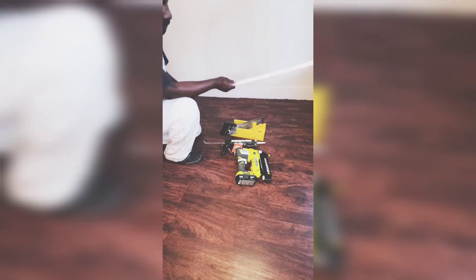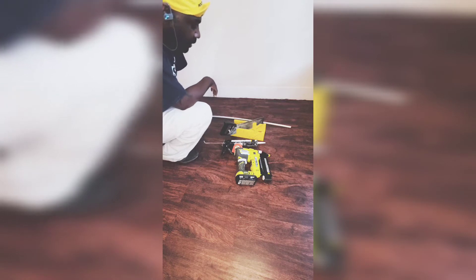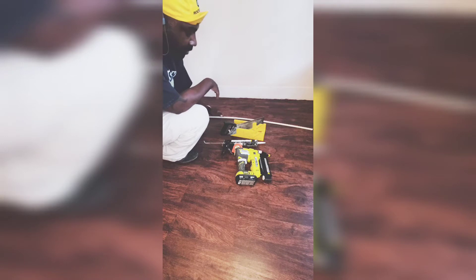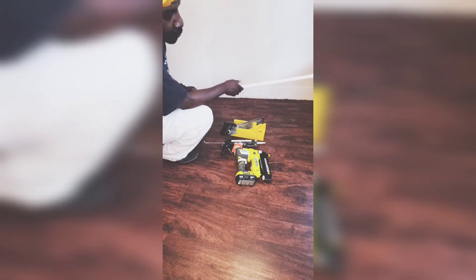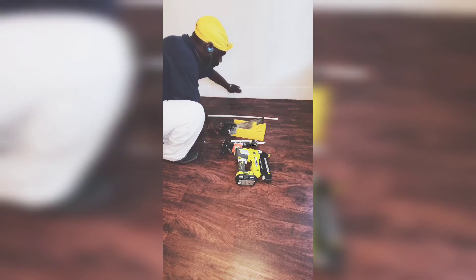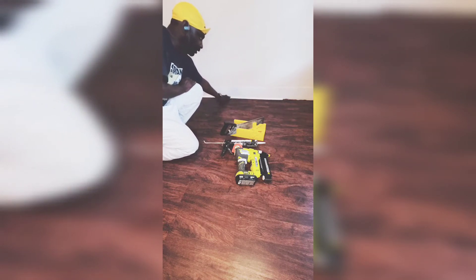This is the shoe mold. It's not wood — I can't think of the material, but it's about $7 per 12 feet. Depending on your house, for an average room, you may end up spending around $30 to $40 in shoe mold material. The size of this shoe mold is an inch and a quarter. Depending on the gap between your baseboard and your floor, that can determine which shoe mold you want to use. When I laid the floor, I put it pretty close to the baseboard, so the inch and a quarter is sufficient in this case.